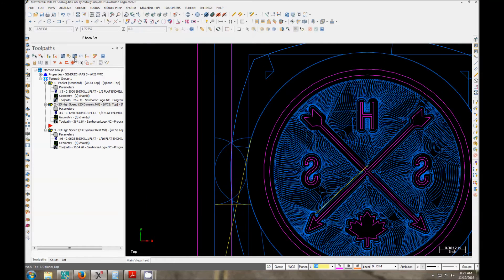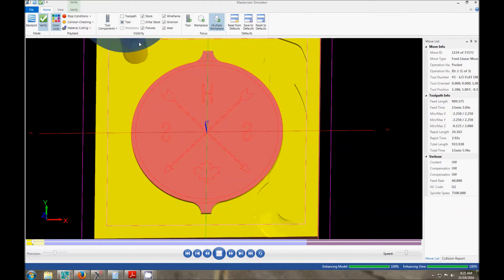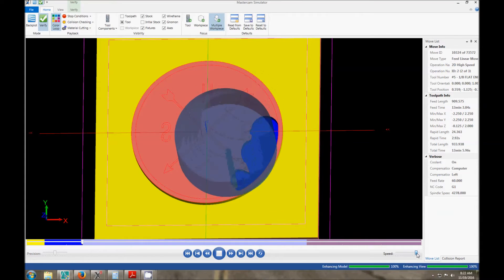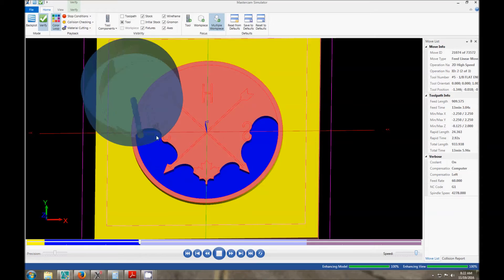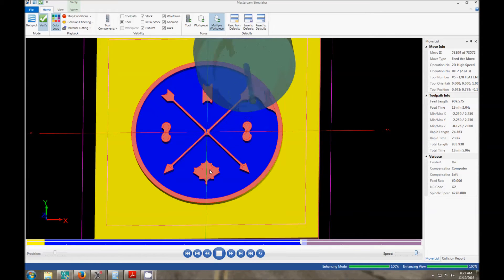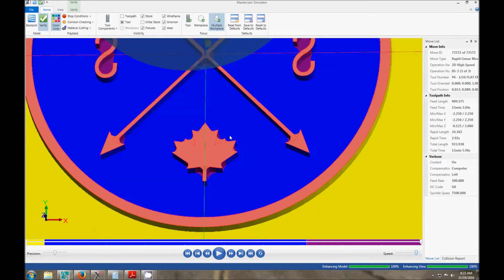So we run this on the screen — let's turn all these on, bring it up, wait for it to process and let it run. You can turn on your tool opacity here. You can see this is going up that 1/8". Color loop is on — I like color loop because then you can see what each tool is doing. It's nice to make sure no tool is going to get overburdened. It calculates how much to take off so it's always taking off the same amount of material wherever it goes — you don't have to worry about burying your tool. Now it's not going to get super close in the tight corners. I could finish that with an even smaller tool but my buddy said it's okay if it looks a little round in there. It's a brand going into wood, so it's going to look burnt no matter what.